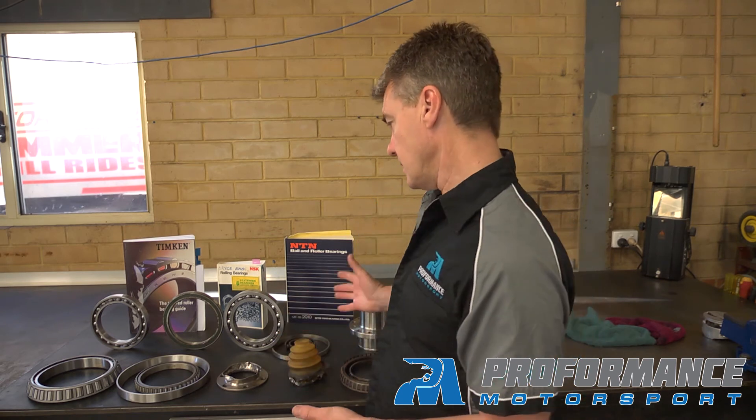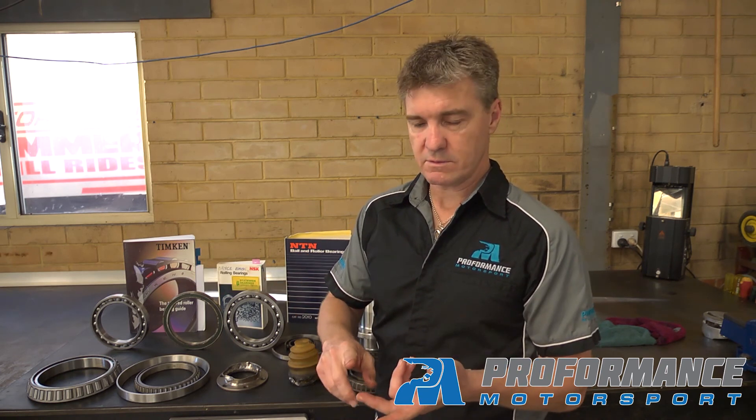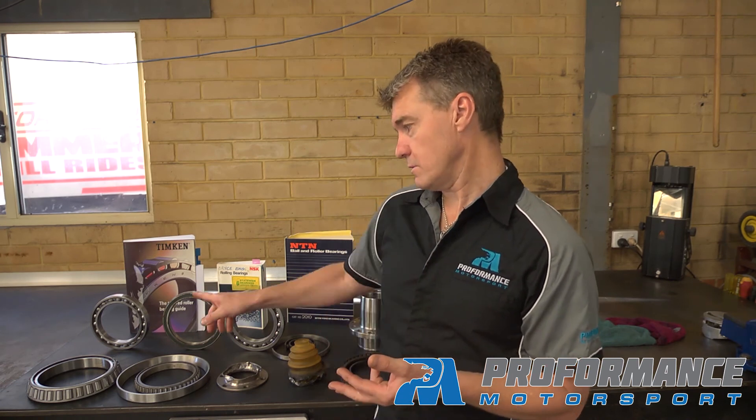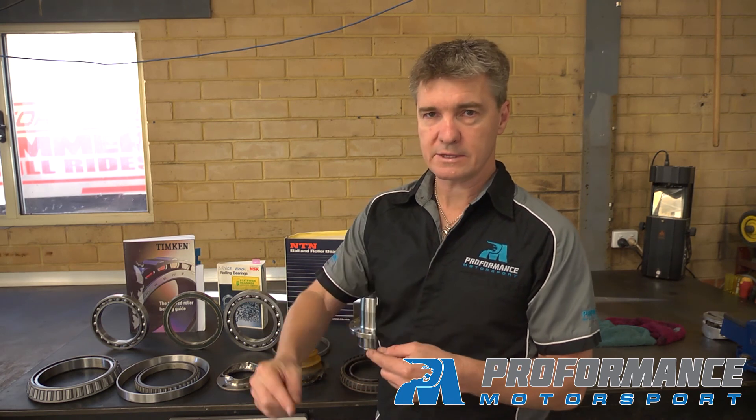I hope that explains a little bit about our bearings, why we've chosen them, why we've chosen small rollers in some applications and large rollers in others. In summary: if a bearing is running at really high speed, you cannot use a low-profile bearing in a high-RPM application without running very, very thin oils and very low oil levels. And if possible, you may need to increase the roller diameter to a larger ball to ensure it's not running at too high a circumferential speed. Stay tuned and we'll try to put up some more technical videos shortly.